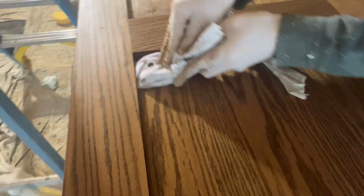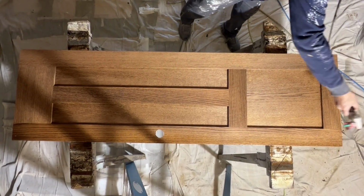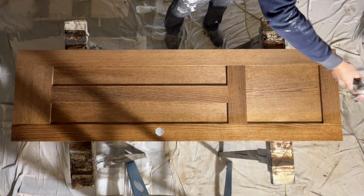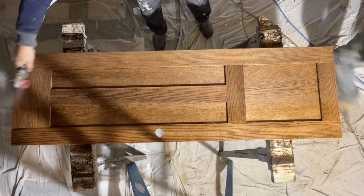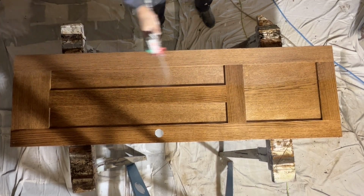If we are just staining one door, a couple of rags is enough. We just want to make sure we aren't using a saturated rag and moving stain around instead of wiping the excess stain off. After the stain ideally sits for a day, but at least a few hours, it is time to apply the clear coat.